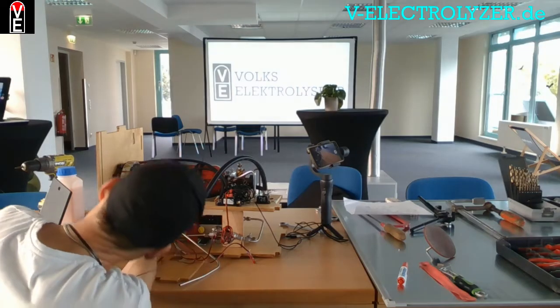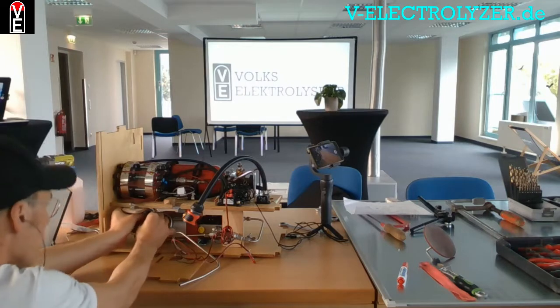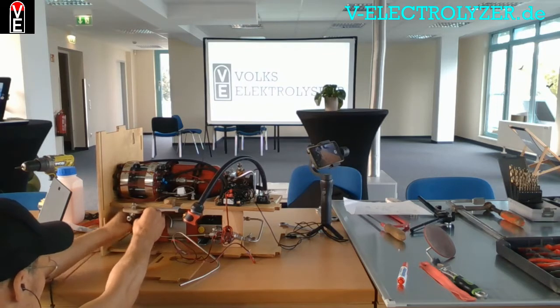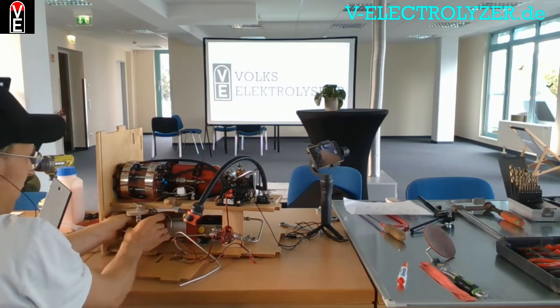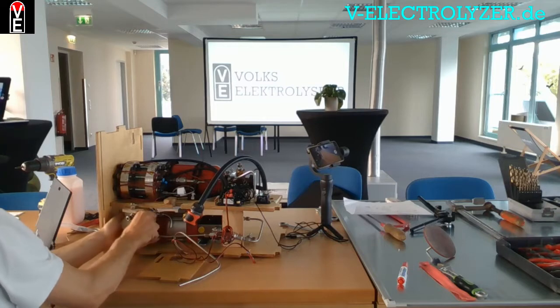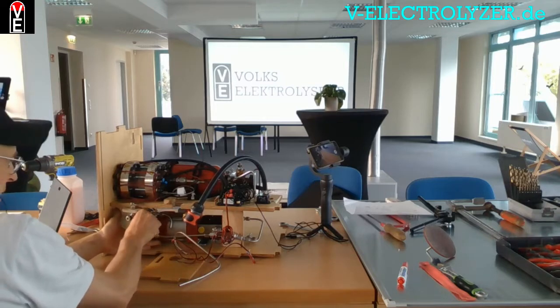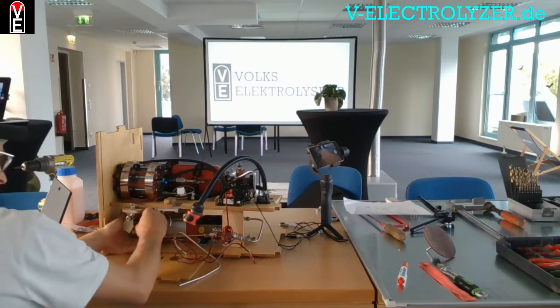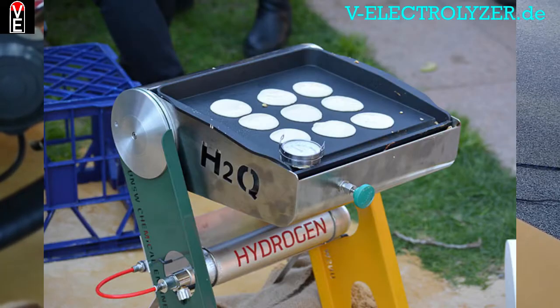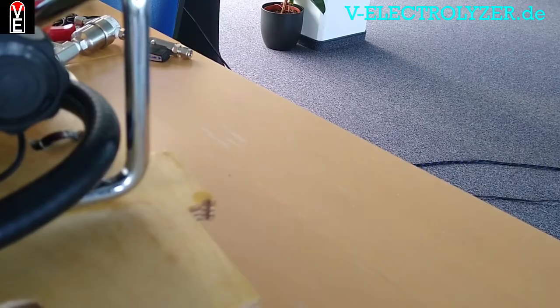This is a valve where you can open and close. For instance, I have a hose for compressed natural gas (CNG), an adapter for 200-bar and 300-bar bottles, and even an adapter for propane bottles — though take care, they only hold 10 bars. If you want to use it for a sustainable barbecue with carbon-free steaks, you can do that easily.